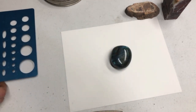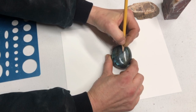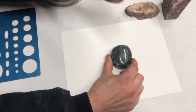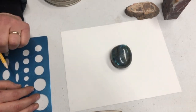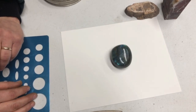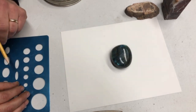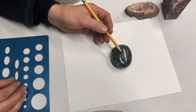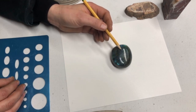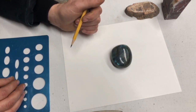However, in this case, I'm going to be one step lazier, and I am just going to mark the center of the soap shape. Then I will put the soap shape X and line it up with the phenolic pins and tighten it in place and make sure it's tight so it doesn't slip. And then I will grind, and I will make this the maximum capacity that I can. So I'm not going to leave or cut any slop off. I'm going to put this on the machine, centered. I'm going to turn the machine on, start to lower the head until I get a round surface the whole way around without flat spots.